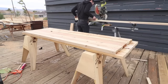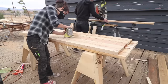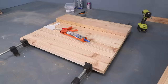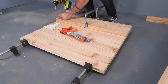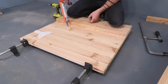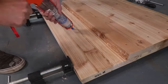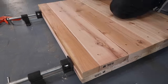While I was getting started on the end panels, I had my sister Jessie sand the side panels to 150 grit. The end panels are just going to be solid slabs with no overhangs at all. The white flex seal was too tedious to clean up, so for the end panels I just used clear silicone. It doesn't spread as easily, but I made sure to do multiple continuous beads so the panels would be waterproof.